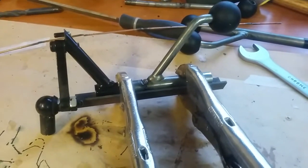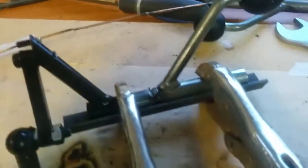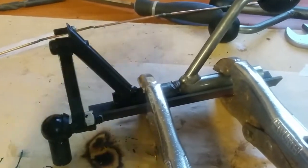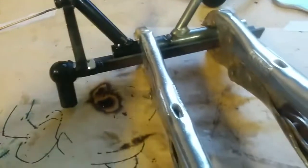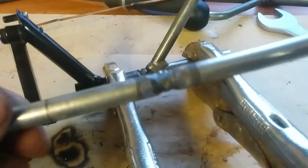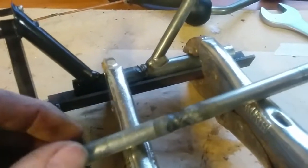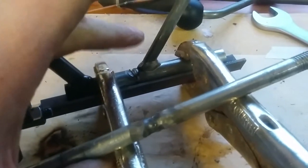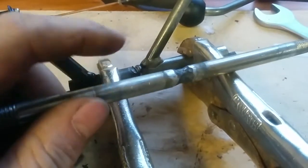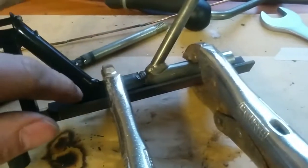So, next step is to align the outer tubing together. Same procedure here. You align them as well as you can on this place here. I mean, you could have put it on this rod here and welded them there, but then it will most likely go a little bit like this, because the tubing is 0.5 millimeter bigger than this one. The ones that keep it really close are the bushings in the end. In that end and in that end.